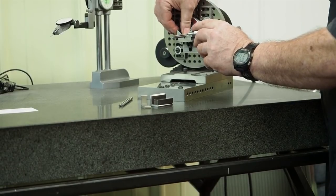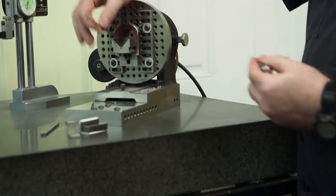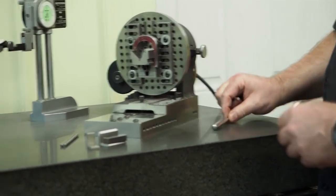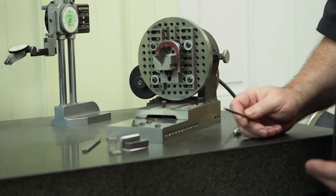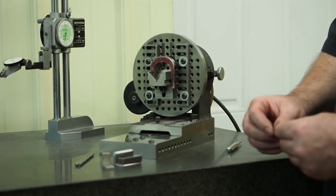I can touch towards the back side, and I was okay. But as I wound out, you can hear that pin start singing. And so I knew it was moving around. I could hear the harmonics already established in it. And that was only taking less than 5/10 per side cut.